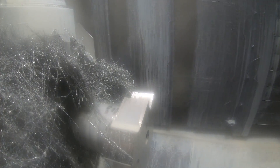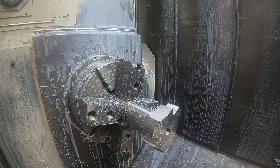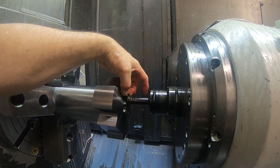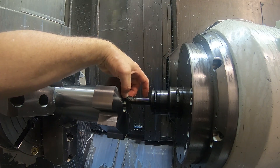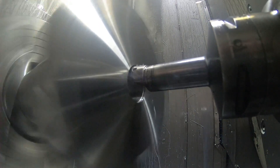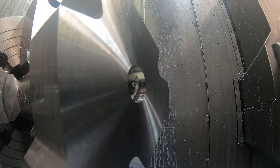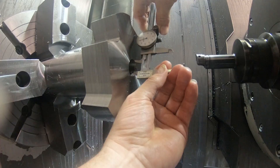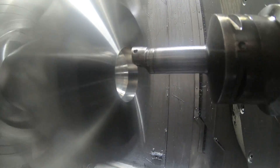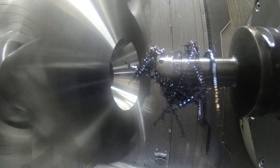So I had to mill this kind of unusual shape in the OD you see there that I modeled in the CAD software. Here I'm going to bore a bigger center. I drilled that hole with the drill before I did the milling so that I could bore this bigger center for the tail stock so I have much better support. Right here I'm just setting the offset of the tool and here's the boring operation. I want to get a good bearing on the live center.